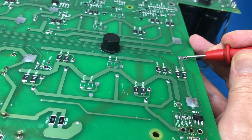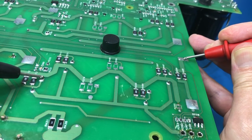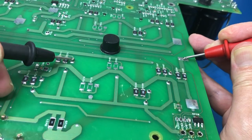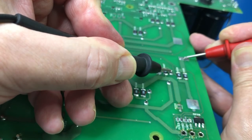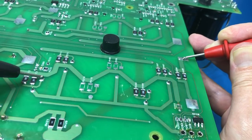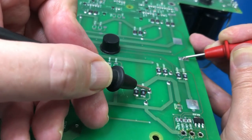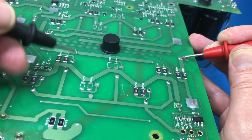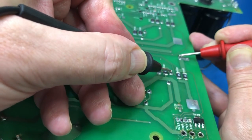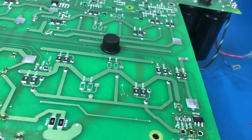So coming back to this channel here, if we go down here, yeah, 1.6 ohms, 23. That's just not right. What is interesting though is if I look there, I see 1.2 ohms. If I look there, I see 1.6 ohms. So I'm seeing trace resistance. That suggests that perhaps not all of the transistors have failed. 1.6, 1.7, 1.6, 1.6, there I read 1.2. So maybe I should start by pulling out that one first, which is the closest one.